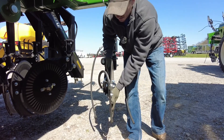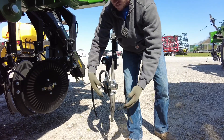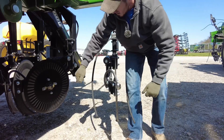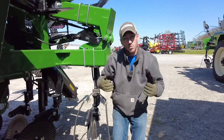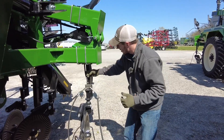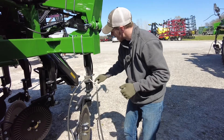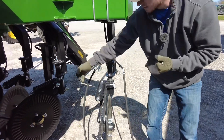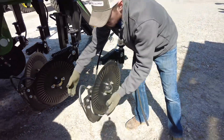So if your roots are here and all your fertilizer is right here, that's not always ideal placement. We don't want to cut the roots when we come through with the knife, so we have to go as far away from the plants as we can. That's where the triple threat allows us to be more versatile — we can run 30 percent of our total rate through the triple threat, orificed after the split so we get accurate side-to-side placement.